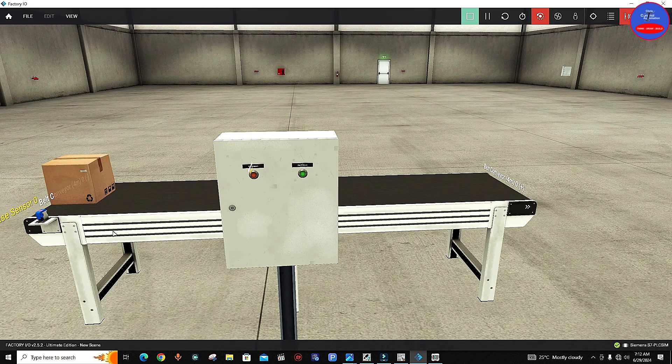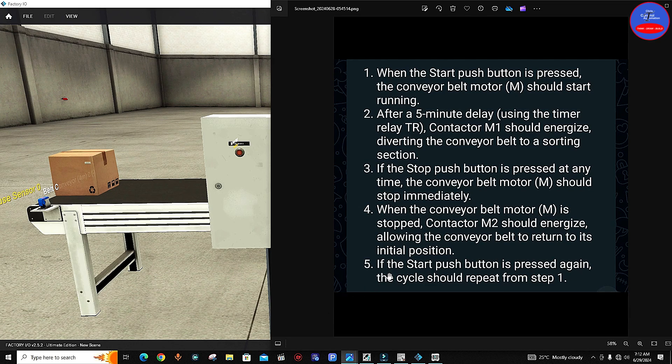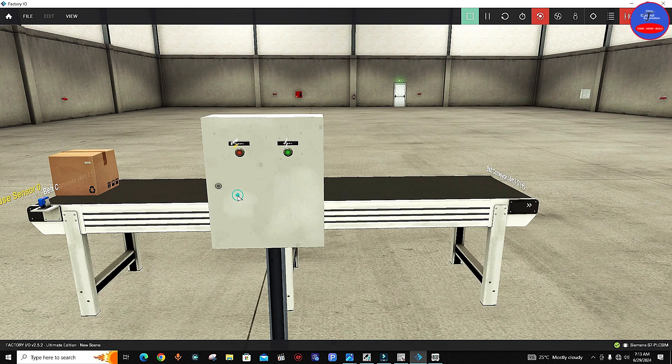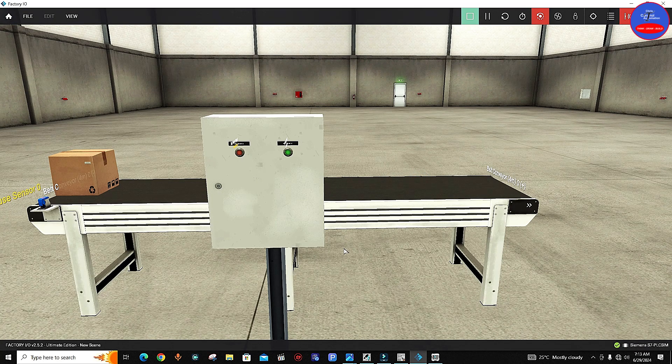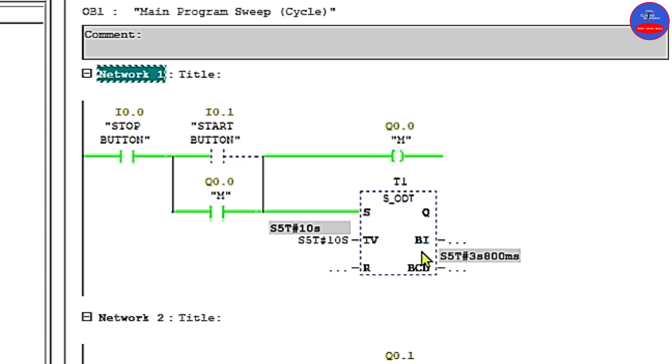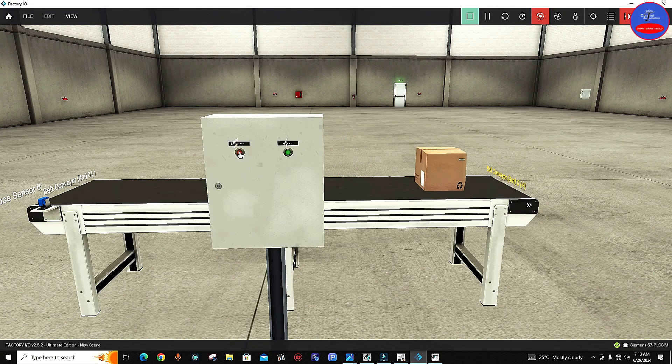So that is the operation of this diagram. The question also said if the start push button is pressed again, the cycle should repeat from step one. So we press the start button again — it starts going in the forward direction. The timer is counting. After the counting it will start moving. When you press the stop button it will stop and then reverse. The moment it gets back to the initial position it stops. We press again — the timer counts, M is energized, the timer is also energized. The moment it finishes counting, M1 will energize as the forward contactor. When you press stop it reverses, and when it gets to the initial position, M2 de-energizes and it has stopped.